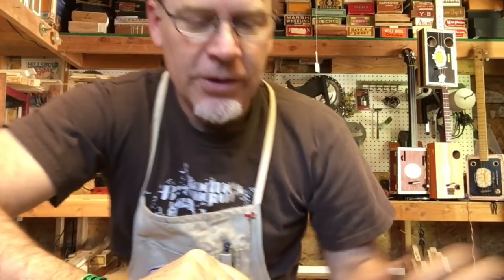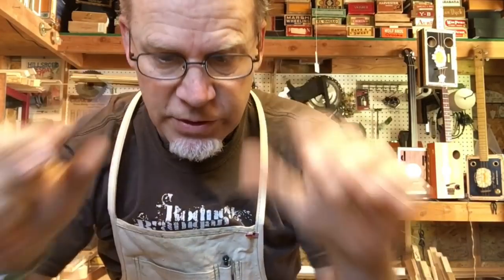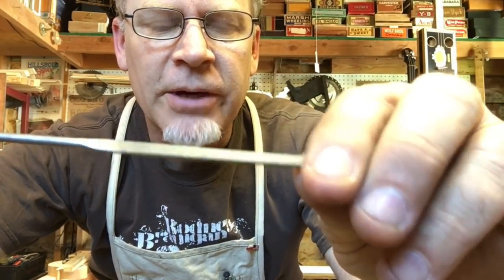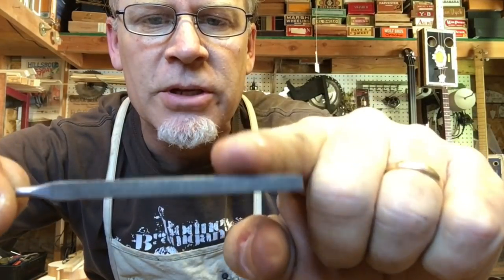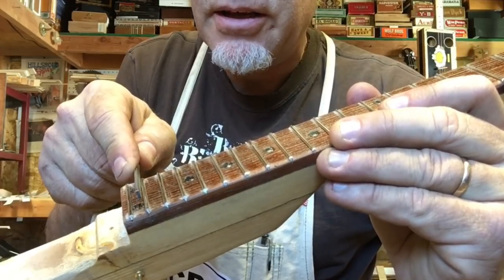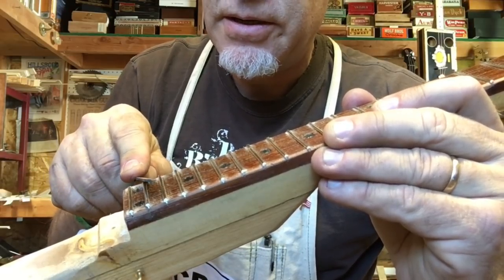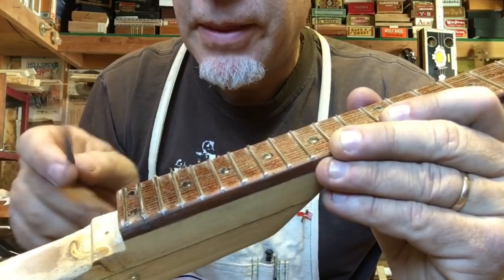Here's a good tip: whenever you're working with up-close stuff, get yourself some reading glasses. Seriously, don't be ashamed — you can see awesome detail up close. These little fretting files you can get anywhere — Harbor Freight, hobby stores, wherever they sell files. What I do is get flat ones and grind smooth the top and bottom so they only have teeth on the big flat side. Then you put the smooth side on the wood so it doesn't scar anything, and curve and pull the teeth over the fret ends. You get nice fret ends without harming the wood.